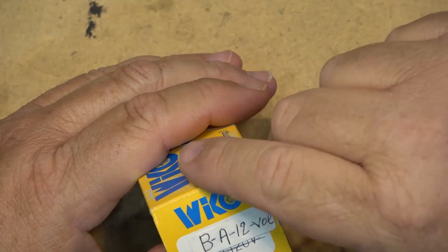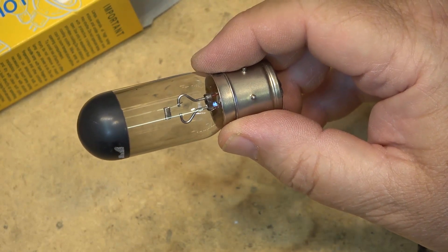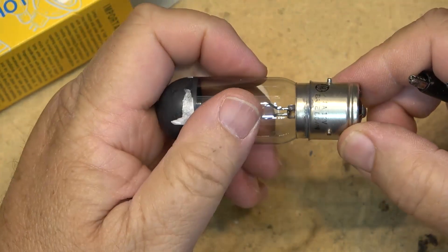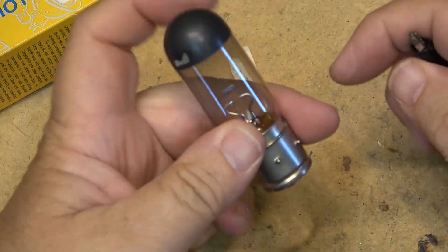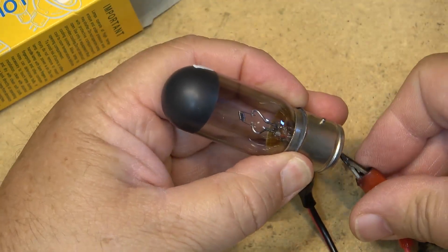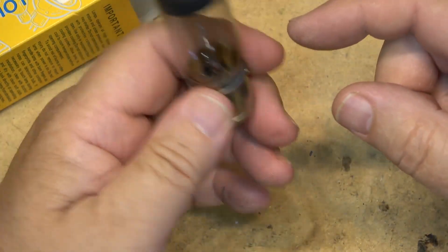Next, this is a BA 12-volt lamp, so let's turn the power supply down to 12 volts. This one should light up quite bright because it's a low-voltage lamp. It says 8 amps, 12 volts, base down — so these had to operate in that orientation. This bulb does look like it's been used — it is black. Notice all the locator pins so that it only went into a specific socket in one specific direction. I'm just going to touch the wire on here — and it's bright! It draws 7.5 amps and that gets red hot. That is another bulb that works.